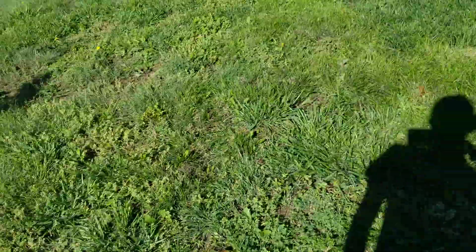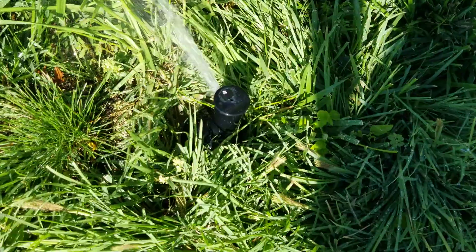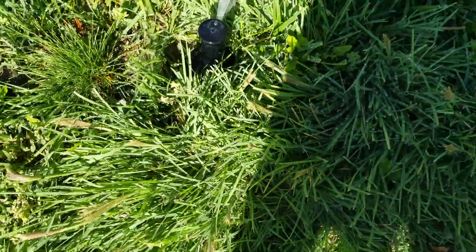There's that one that just covers that corner. This is going to change down to a 1.5 nozzle so it's a better pressure for the station. This one seems to look weak somewhere, so I'll have to check that out and see why it's straining down along the sidewalk there.